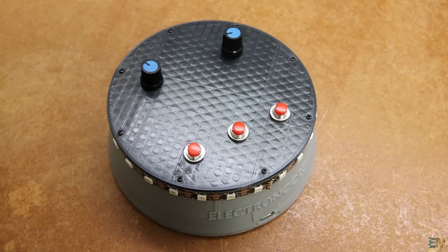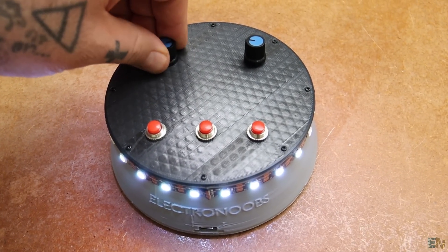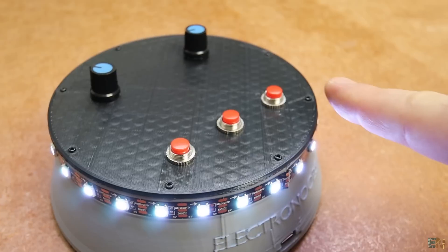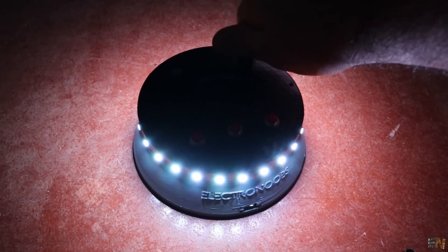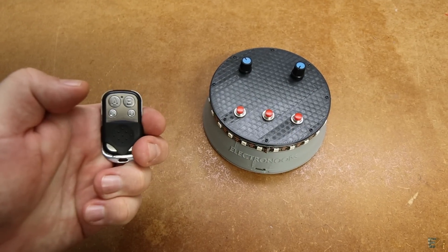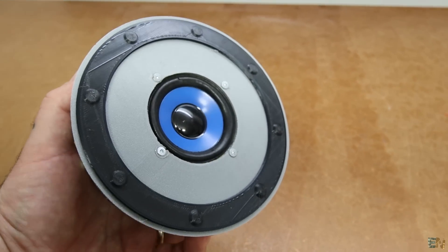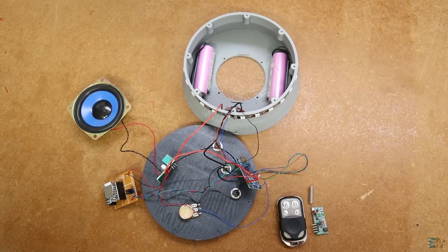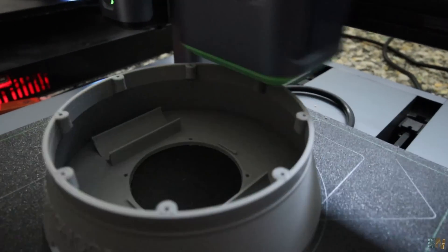Using the volume switch, you can turn on the noise generator. By default, it starts with the first sound. Use the potentiometer to change the volume, and the buttons to change to the next sound. Because it uses EEPROM memory, it will always start with that sound. Use the other potentiometer to change the brightness from 0 to 100%, and the third push button to change the color. Having the radio control is great — everything works as I wanted. You could transform this project into any other toy, alarm, or control anything with sounds or lights around your home. I hope this project helps you and that you learned something new — consider giving me a like or comment below.